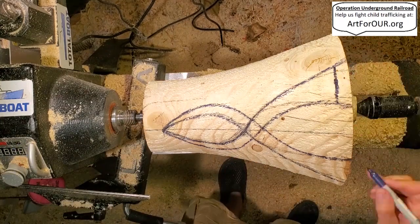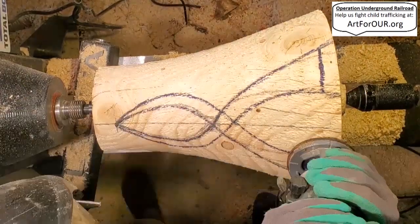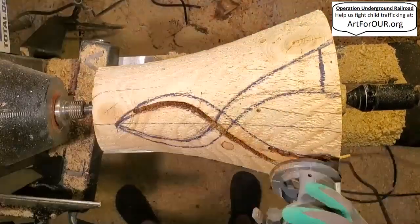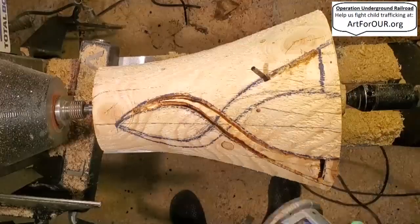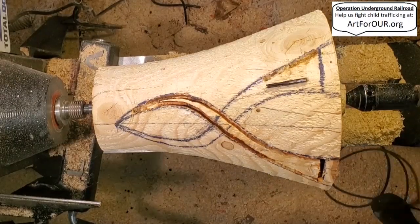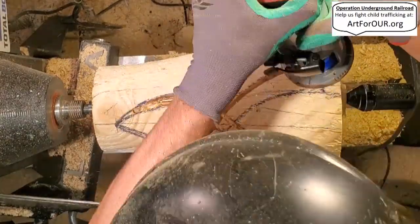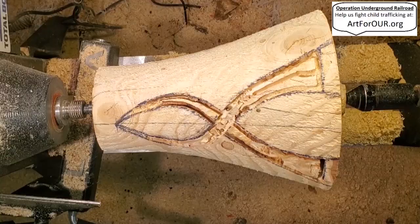I was hoping I could chill it a lot and get away with a deeper pour, but for this specific type of resin, the TotalBoat deep pour resin, I have found its limits. I wouldn't exceed an inch to 2 inches, as it suggests on the label, even if you are cooling it way down.